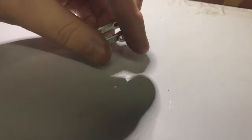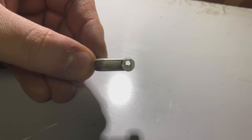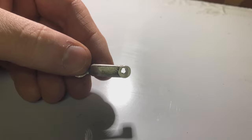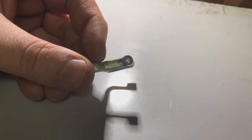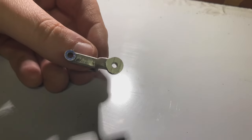I've discovered that the drill bit I used to make the shaft line through there is a piece of rubbish — it's obviously a bent drill bit. Or there's a problem with the mill not drilling straight vertically down, though I don't see how that's the problem since the quill is nice and tight. But the centre on the other side of the boss is not on centre. I'm a little bit cross at that — in fact, I'm absolutely livid. There's not a great deal I can do about it now though.